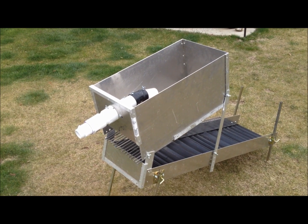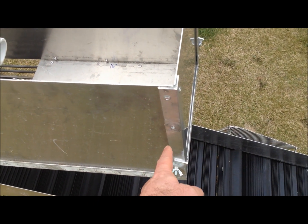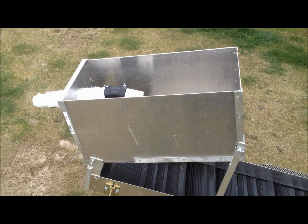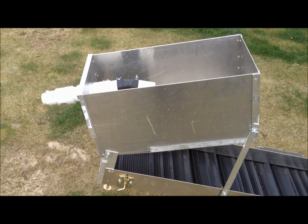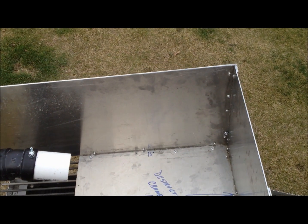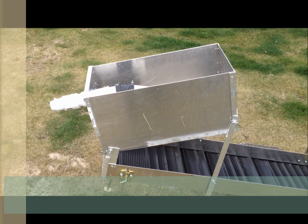Since I didn't have an aluminum bender, on these corners I had to cut the metal to size and then use one-inch angled aluminum. You've got to make sure it's flat on the inside, not rounded, so that your corners fit together well. I went to a materials distributor in my area and had them cut me four pieces that were 12 by 24 inches. It's 12-gauge aluminum — it's really sturdy — and it has really proven to work well.